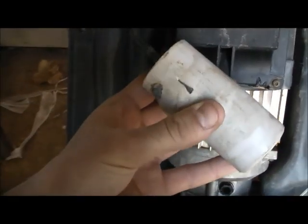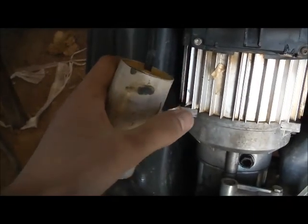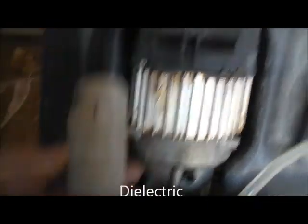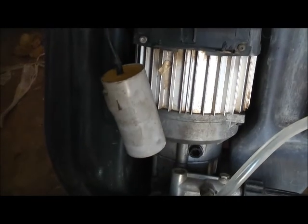I was using it, and this bloody capacitor literally, quite literally took a shit. Now this has been doing it for a while — a bit broke off about the end of last year, it swelled up here. A big bit of insulation came out of here, so I broke that off. It's been starting, but we had to relieve the head pressure for it to start, so we put up with it.